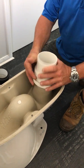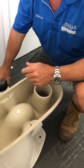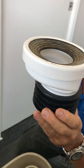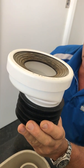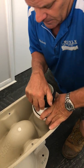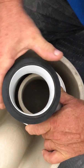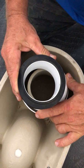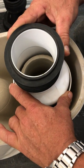That's probably the maximum that I'd like to go. However, there are new pan connectors that offset further again, like 40mm. Now these are the ones that we've been seeing that have been causing problems. When this pan connector goes on the pan for the outlet, you can see how much of the pan outlet has been closed up. So if you get solids and paper, you're going to get it to catch.